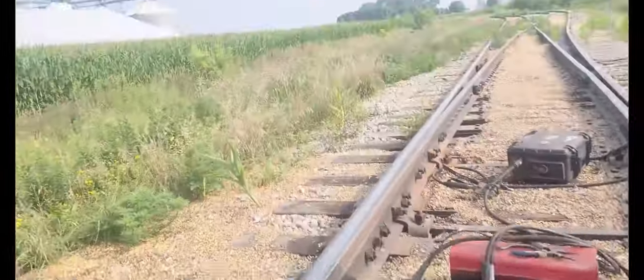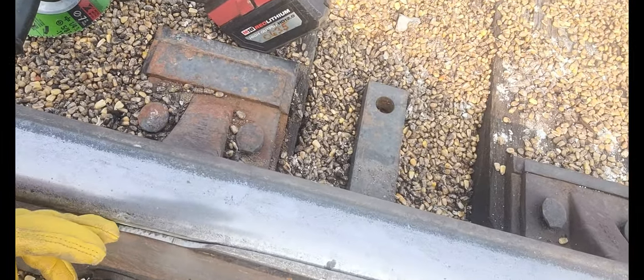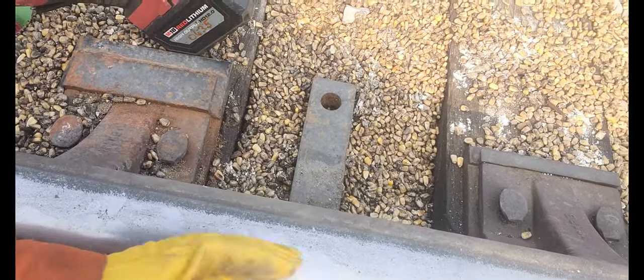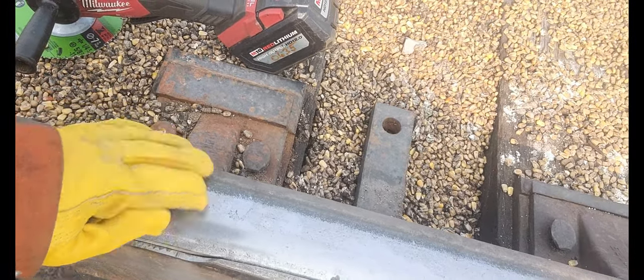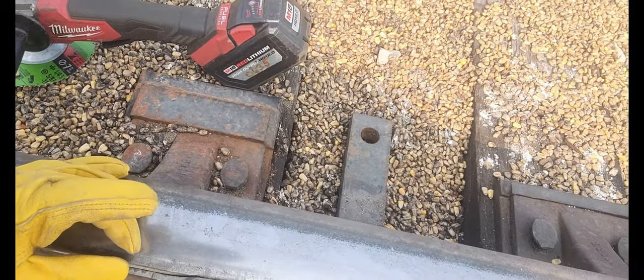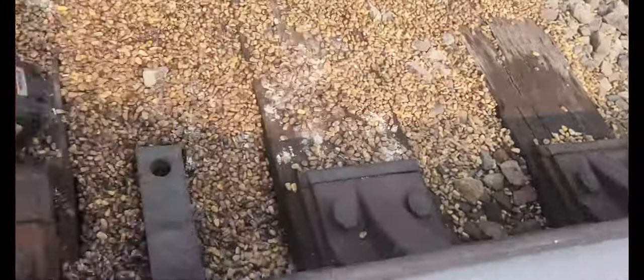Take a look at what I'm looking at here. Making sure it locks up real nice. And over, you know, it's flush with the parent rail. Get all the overflow off so they actually mesh up. Before they were gapped out a little bit. Looks good. Let's get some copper in there and get the welder started. We can get welding here.